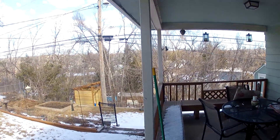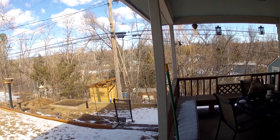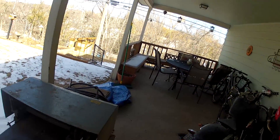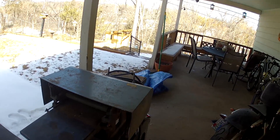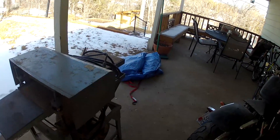Down there is what I'm working on. I did all that work with the chainsaw mill — all from-scratch lumber, cut all the trees down, milled all the timbers, did all the sanding. The problem I found with the six-by-fours and four-by-fours is I didn't have a planer at the time, so some of it didn't come together well because it wasn't square. This planer is to eliminate that problem. Technically I could have done it on a jointer, but I don't have an eight-inch jointer — with this I'll be able to do both.